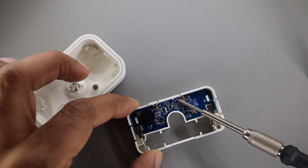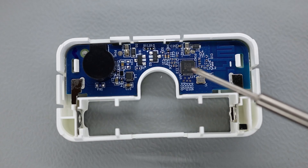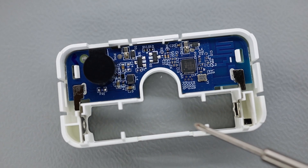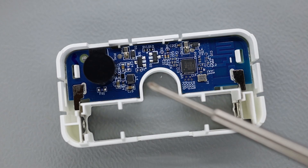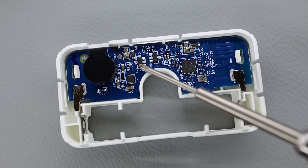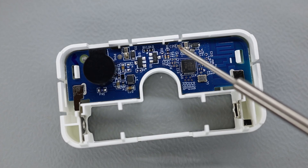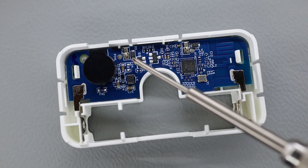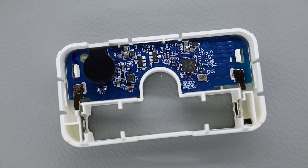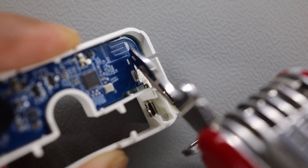Let's zoom in on the PCB. There are a few devices — this is the MG21 from Silicon Labs, a multi-protocol SOC. There's an inductor to boost the 1.2 volts from the single AAA battery, since the ICs won't work at 1.2V directly. There are also two diodes sitting next to the spring contacts — these are likely TVS diodes for ESD protection. There are two more SMD parts whose part numbers we'll analyze. Let's take the PCB out and check the back.